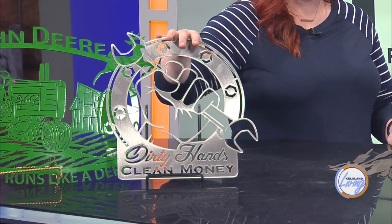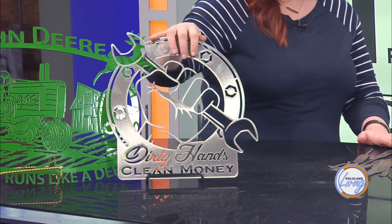Once we have that done, we take it — and this is the piece we were just watching video of, the piece that was just cut out. On the back side it's got what we call slag. So this is the raw metal itself. We then take it and run it through a sander — it's a big belt sander — and that's what this piece looks like. This one has been clear coated, so once we've done the sanding it cleans up the metal, makes it look nice, makes it look essentially pieced together, not so rough on the edges.